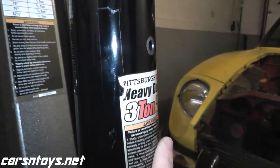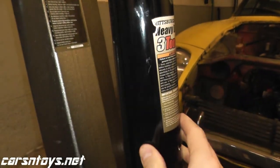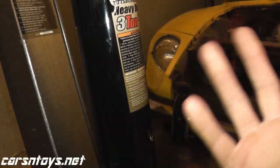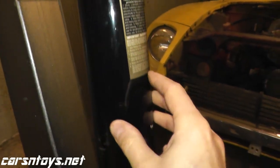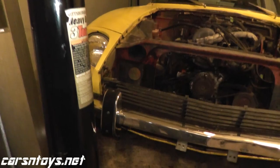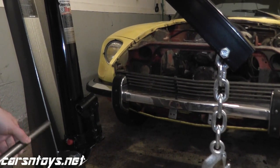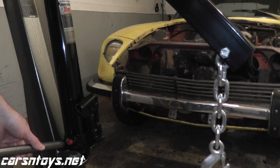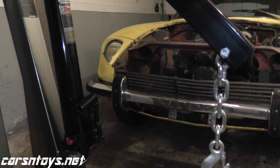The very last step is bleeding the system. I removed the oil plug and there was no fluid in there whatsoever — I'm not sure if that's the case for every unit Harbor Freight sells, but check to see if you have hydraulic fluid. We're going to bleed the system completely. Right here you have the release valve — they include this rod which goes over the valve. Clockwise is fully tightened; counterclockwise is to loosen it. So loosen up that release valve.